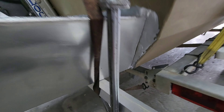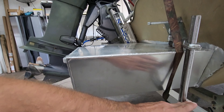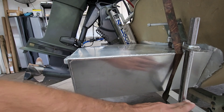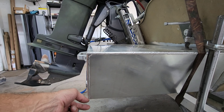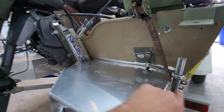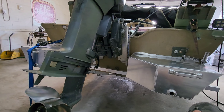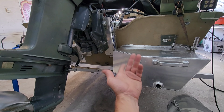I've got about a half inch of the pod sitting up on top of the bottom. I talked to the people at Beaver Tail and they said that's fine. But the back edge needs to be a half-inch difference when you run a straight edge up under the bottom of the transom. Since we're already starting out at a half inch, we'll end up with a one-inch gap there. That probably means I'll have to pull this out and add some filler pieces. Once I get a couple good tacks on the bottom, I can hinge it up or down to get the correct measurement for the outside of the pod.